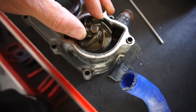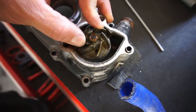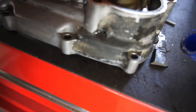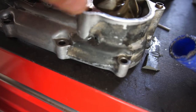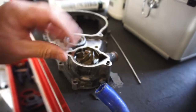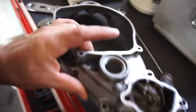That is a lot of play - so guess what we're doing. You can see the weep hole - when I spin it, right in there you can see it bubbling, which tells me I've got to order a shaft bearing.